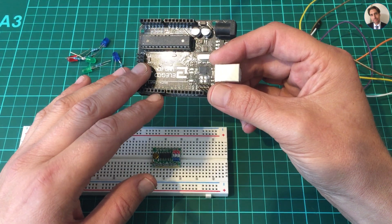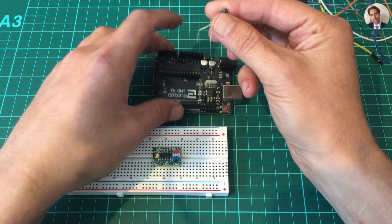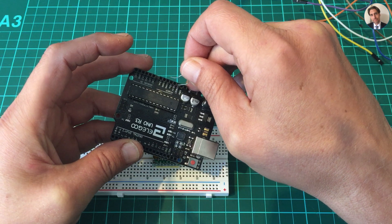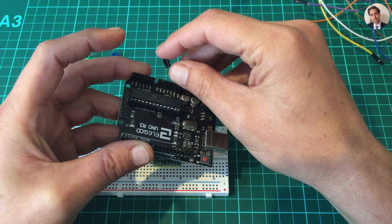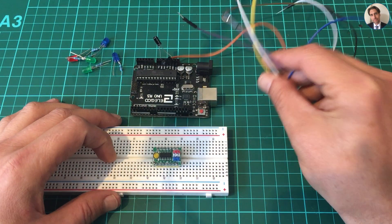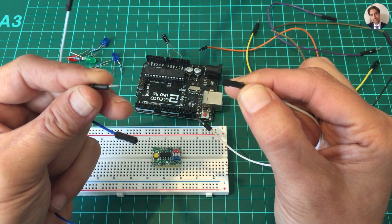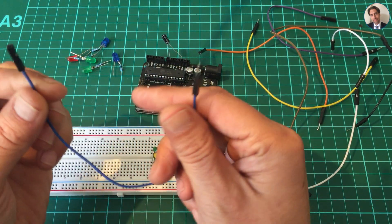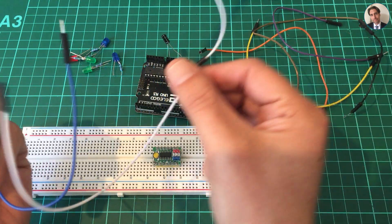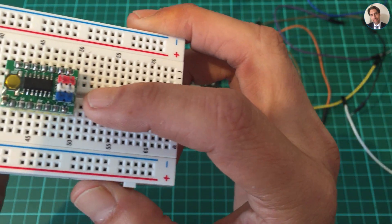After that, to keep it from resetting itself, we need a capacitor between reset and ground. Make sure the negative goes to ground. Now all we have to do is hook up these wires, and as you can see some of these are a bit botched together because I didn't have enough male-to-female hookup wires, so I'm just making a few as I go.